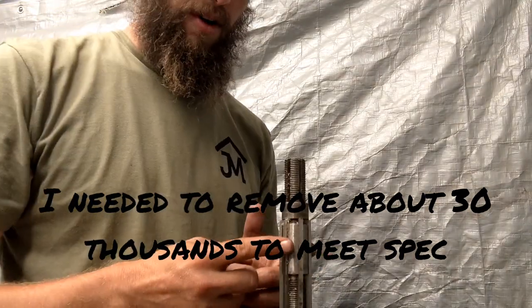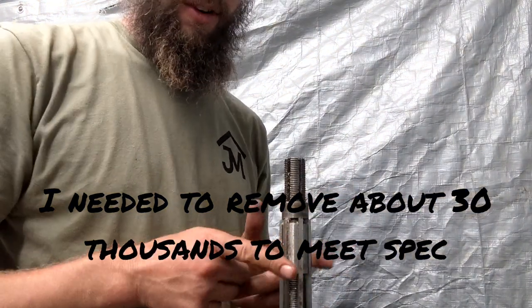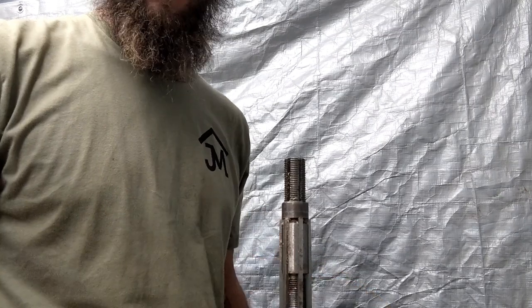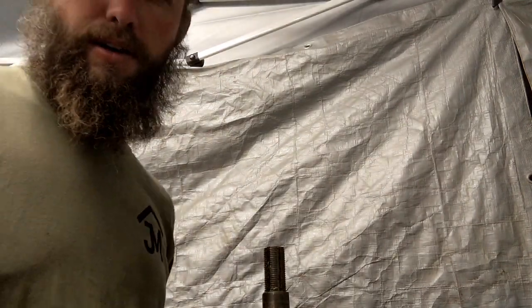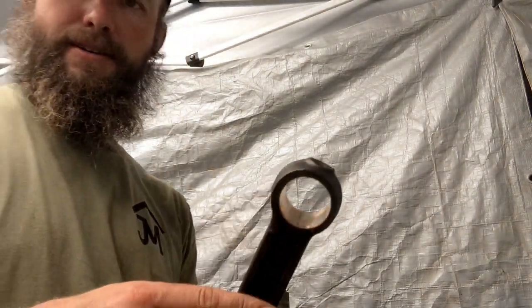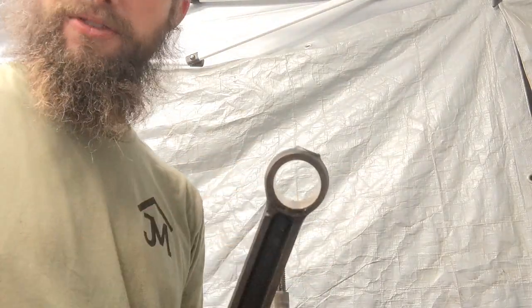So then you measure across the reamer here. You measure across these teeth, see what that's currently measuring. You make a slight adjustment, measure it again. You do that until it gets to where you want it. Reamers only have a capability of taking like 5 to 10 thousandths at a time. So I've already gotten started here. On these, I've taken out of all of them about 10 thousandths on my first kind of rough cut here.